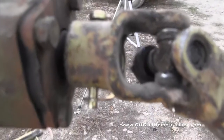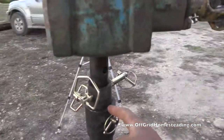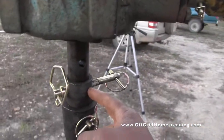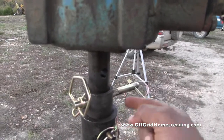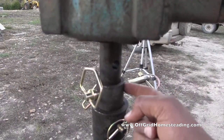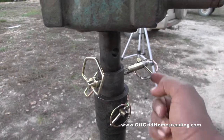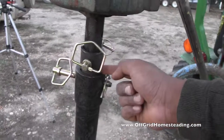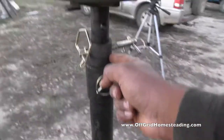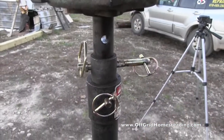It actually sheared the bolt I had in here directly off, so we tried a new pin. The central sleeve was just kind of rusted in place. This sleeve takes up the slack between the shaft itself and the sleeve — the bottom part has a pin that goes through and attaches to the sleeve, and the top part of the sleeve attaches directly to the shaft through that.